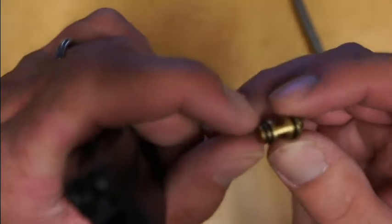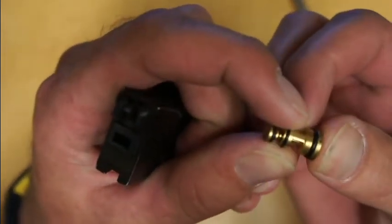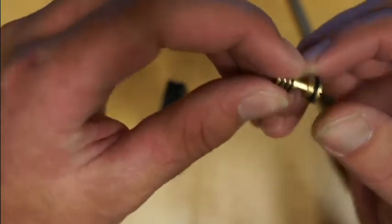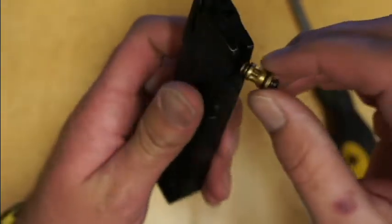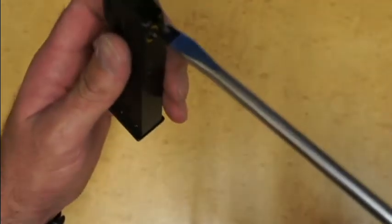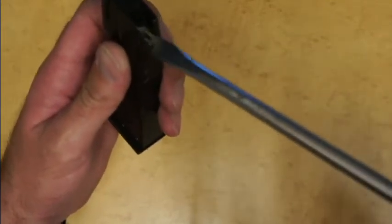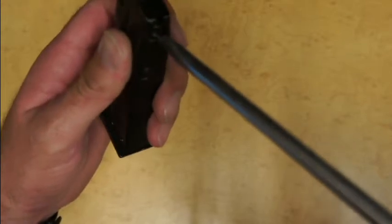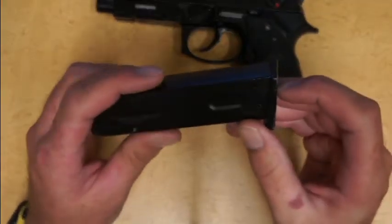The plunger actually has three o-rings — one, two, three. These are a little bit harder to buy because they're smaller than your average hardware store o-ring. You can inspect and clean them; they usually don't go bad. By the time these go bad, you're probably going to be on something bigger and better anyway. Make sure not to over-tighten it — when you over-tighten the o-ring it becomes worthless. Just snug it up. The biggest problem that normally happens...